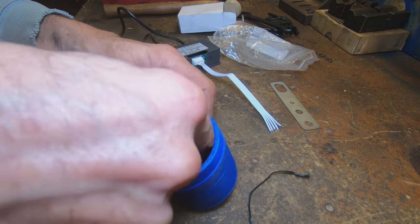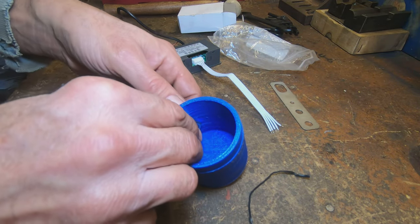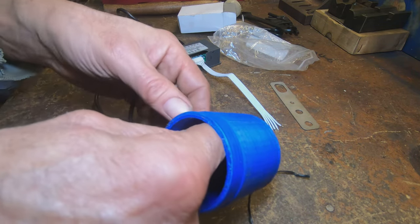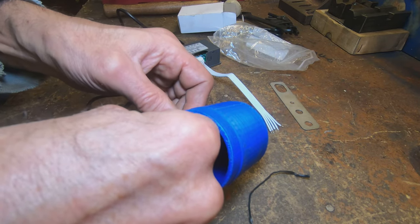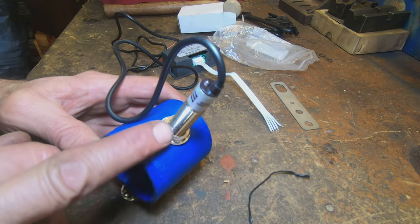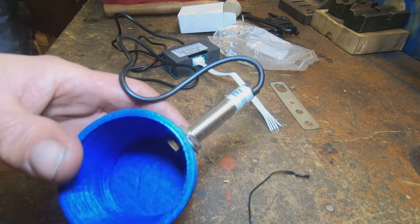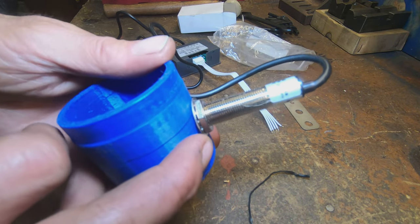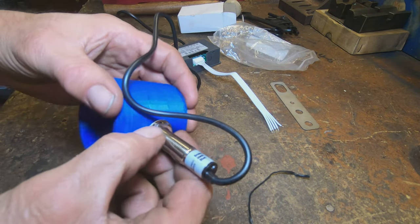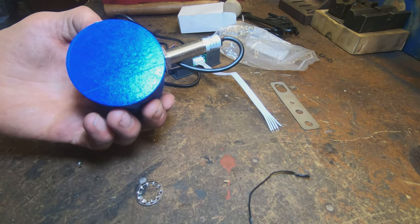There's so much variability in 3D printing — even between different materials on the same printer, even between different days with the same material on the same printer, whether it's background humidity or temperature. What I will do is redesign it — give myself a little raised flat land there and a little flat bit inside, because I never like screwing bolts through a curved surface. It's messy and doesn't grip properly.